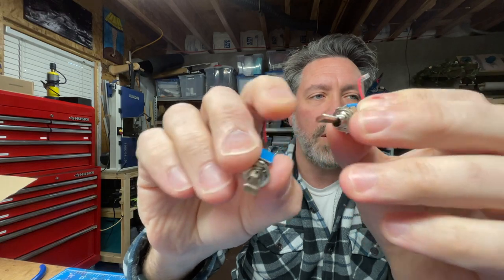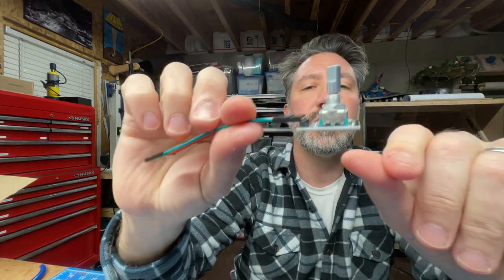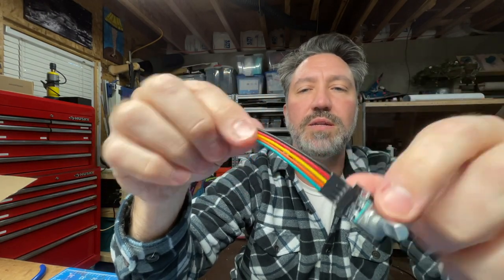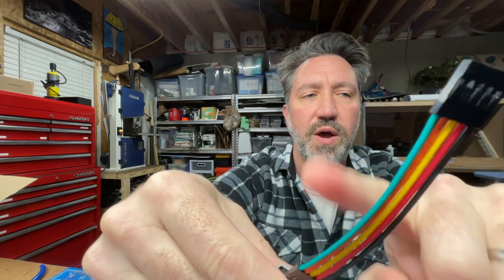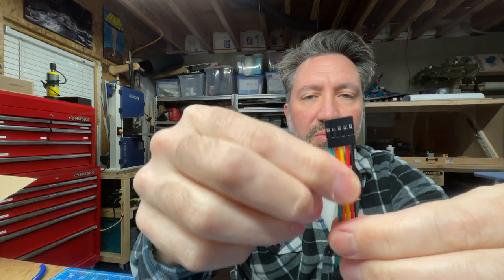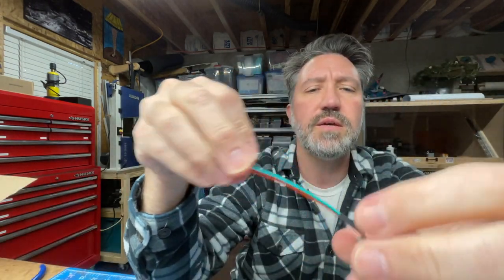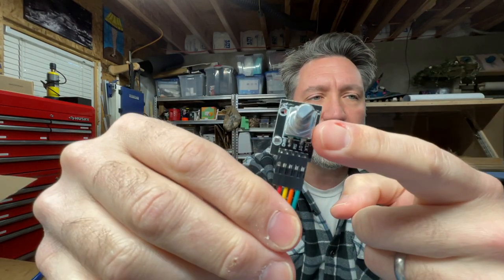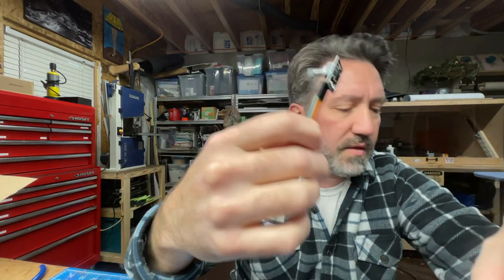You will get two flat paddle toggles — these are a little wider and have a nice satisfying clunk. You'll also get a rotary encoder with a Dupont connector, either a five-pin Dupont or five individual wires. The wire harness shown here I made myself by ordering the parts separately. You should get all of the wiring — colors may differ slightly — and everything is labeled, so it's really just a matter of matching label to label.